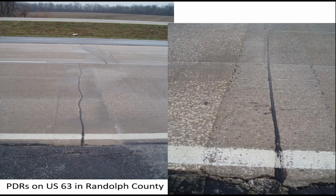In this case, this is the full width of a lane. I don't have a before picture, but I'm sure what happened here was that we had a lot of spalling at this working crack. It was milled, and in both lanes you can see the offset of the one on the inside, or the passing lane. But looking at the driving lane, you can see that you had the full width of that lane. That material was all removed, crack former was put in appropriately, and the surface was prepped and cleaned adequately.